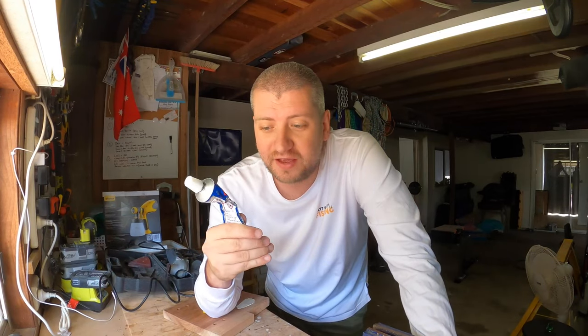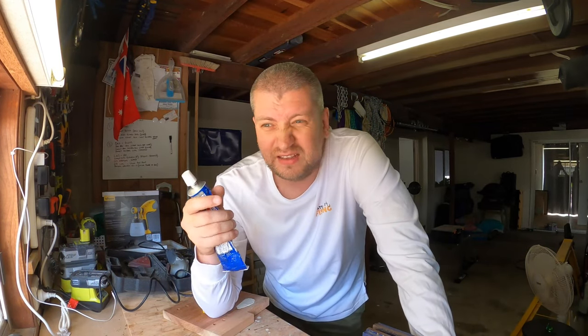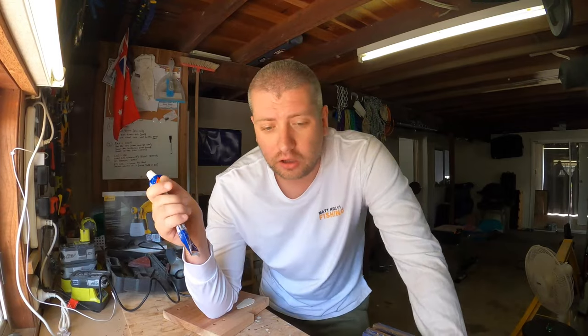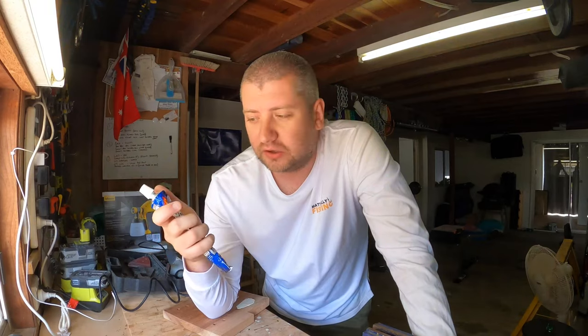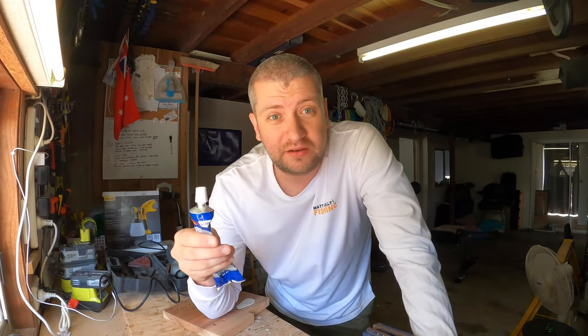The best way is to re-fiberglass it, but often that's hard and time-consuming and people don't have the skills. So the next best thing is something like Sikaflex - a silicon-style sealant, always get the marine stuff. It squeezes out like toothpaste, you can use gloves or even your fingers to clean up the edges before it dries. The challenge is when it dries, it dries really really hard - you might glue a piece of wood to the back of the boat and it could take hours of prying to get it off. Once it's on, it stays on.